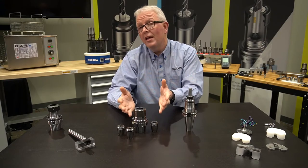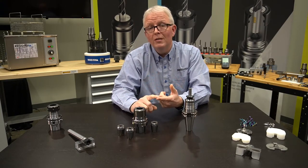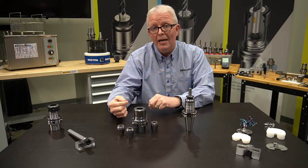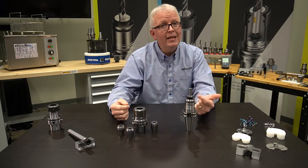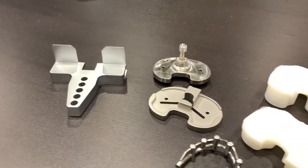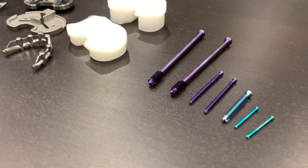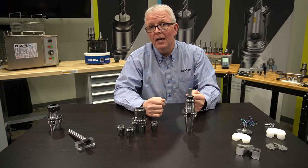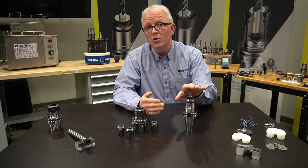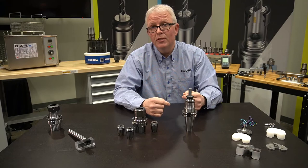This would be where you would go if you don't have the option to change to a power grip system. The MR system allows you to get one-tenth TIR and the changeability of swapping collets like you do in a regular ER system, but gives you that high accuracy. The power grip system would be your ultimate endpoint for accuracy and precision to make sure those implants or parts you are making for the medical industry meet true specifications. The power grip system is going to have much higher clamping force than any ER or other collet system, have the 3 micron TIR, and that five-year, 20,000 cycle guarantee on tool life. So the power grip system would be your ultimate application solution for medical applications — highest accuracy, highest rigidity, and the best repeatability you can get on the market.